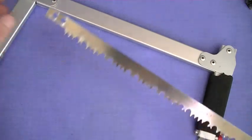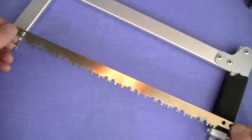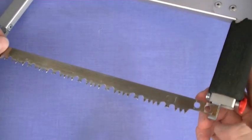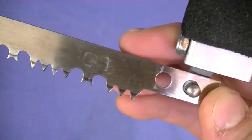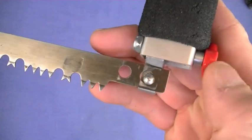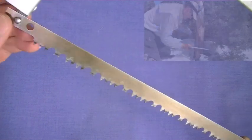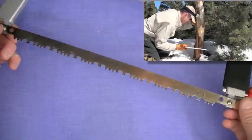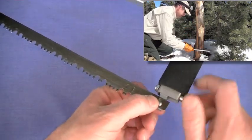Let me tell you this, by the way. It's a multi-directional blade. It really doesn't matter which direction you put it on; you can flip it over that way or that way. The way I put it on, I put my back pin like this. These are your retention pins. The reason I do that, don't extend it to that second pin, and I've done this, because then it'll get in the way of your adjustment knob. Then I'll come up here and put this one right here. Make this as tight as you can when you mount that blade. So you put the blade on the pins, just like I did, and then I'm going to start cranking it.